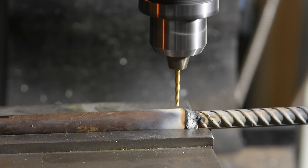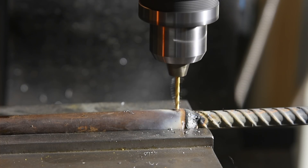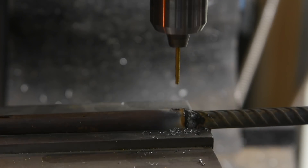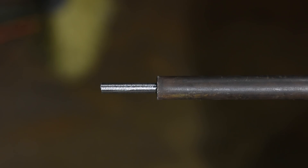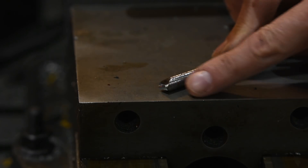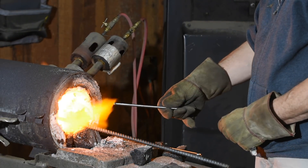After welding on a handle made of rebar, I'll drill a small air hole at the base. When I insert the rod, it's going to be hot and covered with flux, which would tend to seal the bore, making this into a sort of pneumatic piston, which would likely prevent me from being able to insert the rod. I'll want to pinch the tip shut so that the tip of the knife is composed 100% of hardenable steel, so I have to make the rod shorter than the bore — in this case, about half an inch shorter.